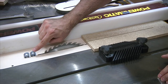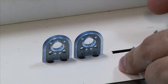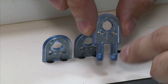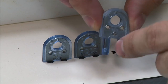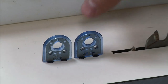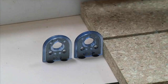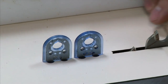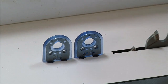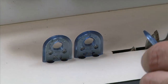One very cool feature is what they call their mini featherboard effect. With the standard setup, you'll see it has the letters 'MJ' on the outside, which means that side is perfectly flush with the blade. If you want to create the mini featherboard effect, you can flip the piece over or use one of the other splitters that has a plus sign on it — meaning that side has more material, specifically three thousandths of an inch. So if you put that plus side facing the fence, it's going to push outward slightly, and as the workpiece clears the blade and makes contact with the splitter, it will gently push it into the fence, creating a mini featherboard effect. Depending on your setup, the wood type, and how much tendency it has to bow, you can fine-tune this. One splitter has three plus signs, which is nine thousandths total — really dialing in the safest and most secure cut.